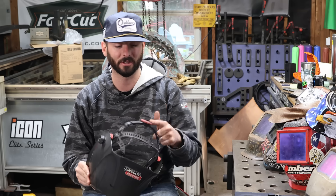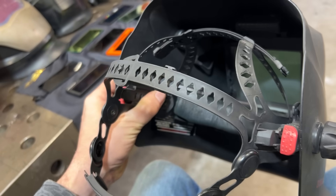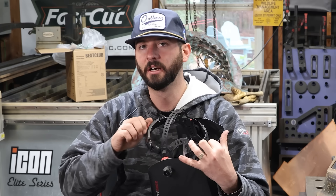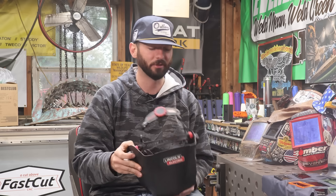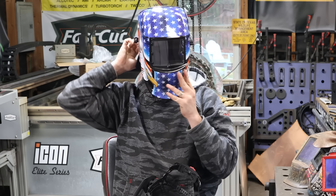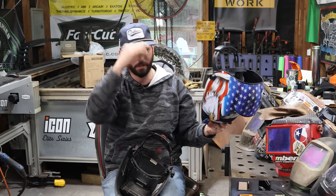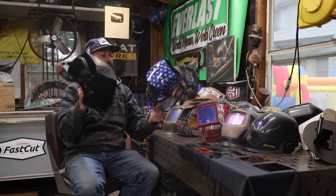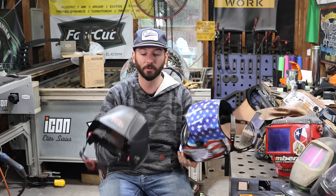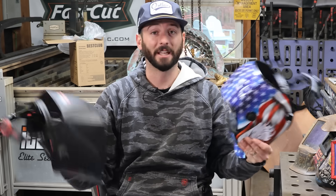This is probably one of my favorite headgears off these Vikings. You get a lot of connection points to your head — two here and then a little bit for your dome. And that ratchet has some real crank to it. This headgear fits anybody's head no matter who you are. Adjusting that headgear is super important for someone who's new. You can weld with both of these hoods, but it's all about the longevity of the lenses. If they're going to flash on you or you're welding in tight spots, the cheaper hood's not going to cut it.